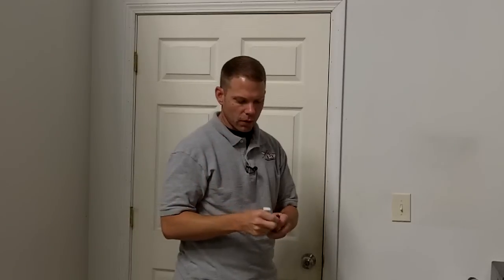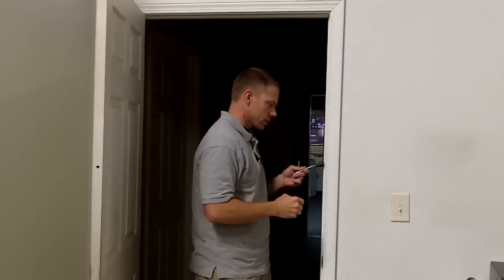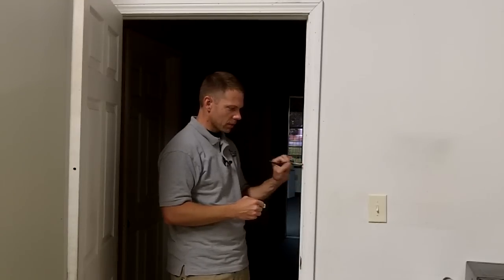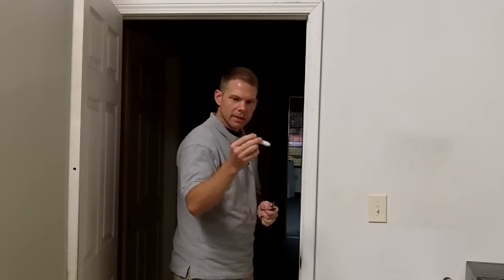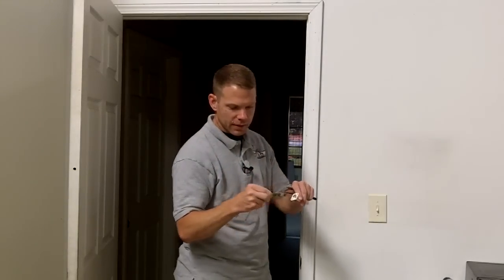The contact itself takes a three-quarter inch hole. What I use is a three-quarter inch spade bit and you're going to go into the jam and drill that deep enough so that the contact will sink in there. I've already drilled this one for time's sake, but you can see how far that goes into the door — I've just taken a cordless drill and drilled that three-quarter hole straight in. The cover on the front of the contact opens up. That's where your transmitter and battery are going to be installed. You just take a little flathead screwdriver and open the front of that up.